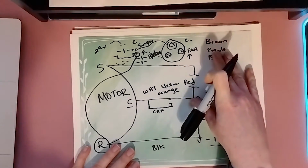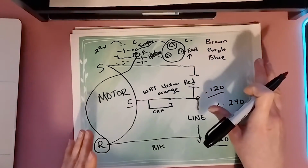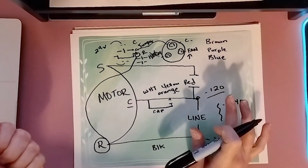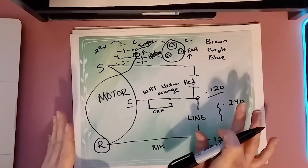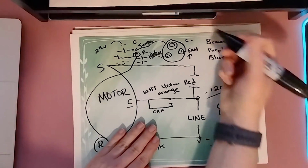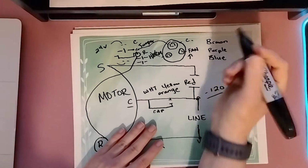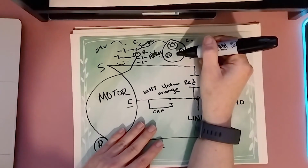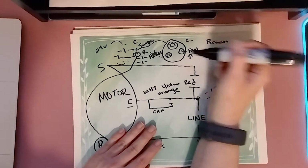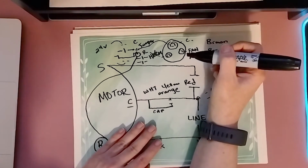Make sure your disconnect box is pulled. If you want to be extra careful, you can turn off your indoor panel and make sure there's no power going out there. Always use a rubberized screwdriver, something that's non-conductive on the handle but metal on the tip. Touch it on your capacitor and that should discharge it if it's holding a charge at all.